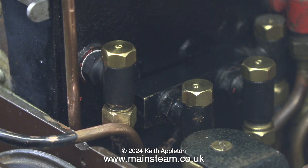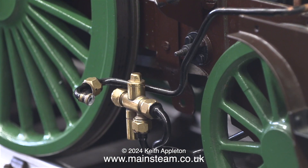I haven't removed the ball from the check valve. I am going to leave it in place and see whether the injectors lift two balls. With the engine in steam, when I test the injectors, if they don't work I will remove the ball from the check valve that screws into the boiler.